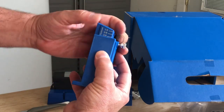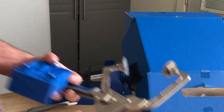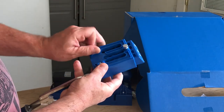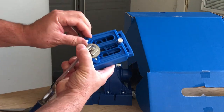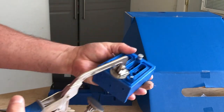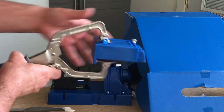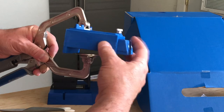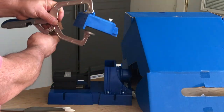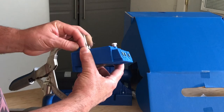Let's say you've got to do a sheet of plywood — you lock that in, grab your clamp, twist it out of the way, and put it into the pocket. You put this onto your material, clamp onto it, and now you can run pocket holes. There's a little lip here so you catch the board or sheet you're trying to put holes into. You drill your holes, then snap it off, move it over, snap it on — snap it off, snap it on — and you can do really large pieces of sheet goods with this handy accessory.